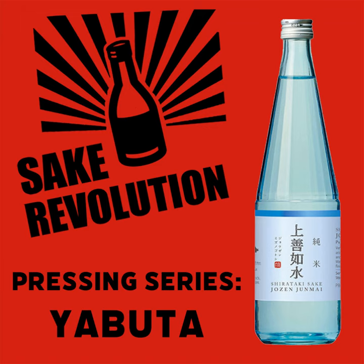The compression arm on the side holds all the frames together. Then the mash is pumped in along the top and goes down into those sections between each frame. Every other frame is actually a bladder or a balloon — so every other frame is metal and solid, and then the next one is a rubber bladder. They pump air into the bladders and they squeeze both sides, applying pressure to the mash trapped in those frames. At the bottom of the frame there's a little slit where liquid gets pushed out.